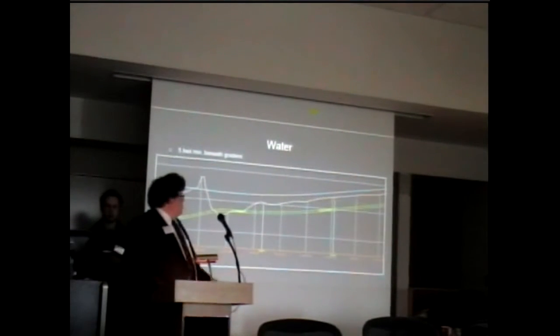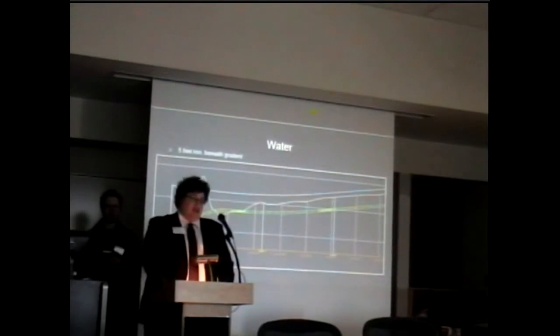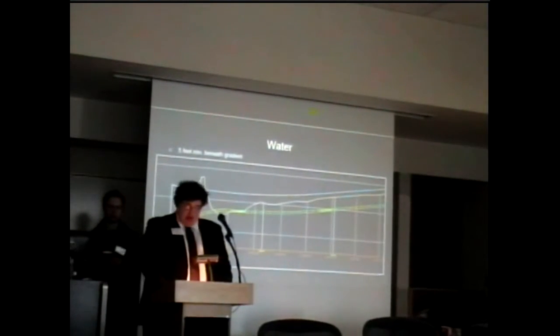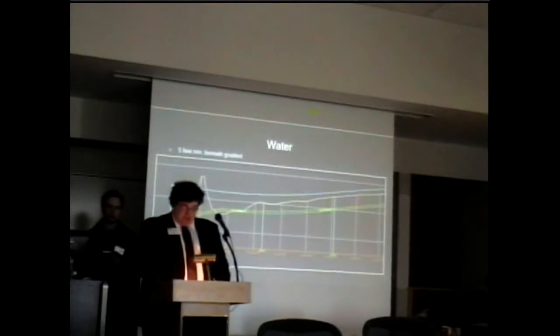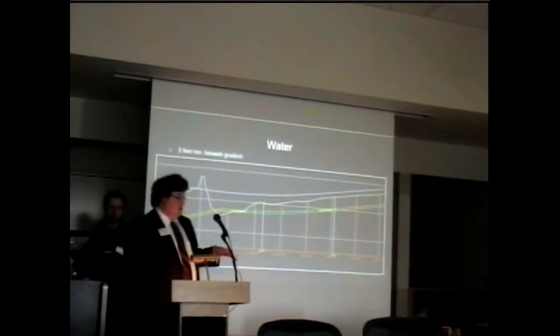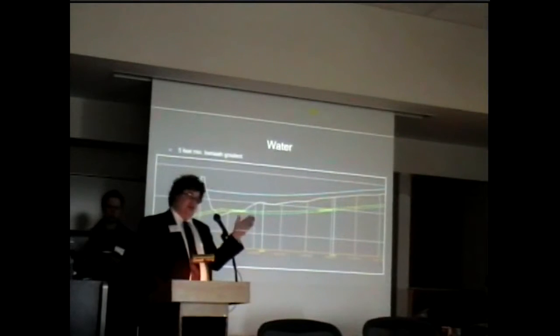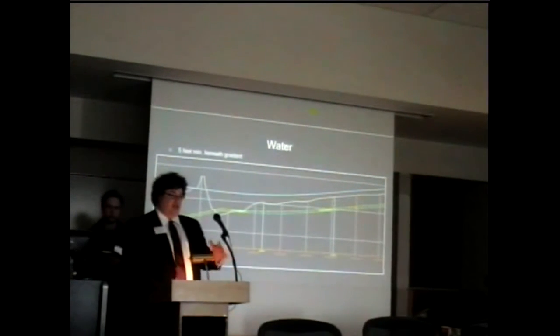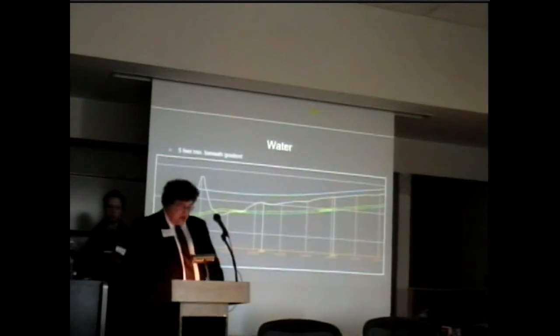The vertical for it is pretty similar to the sanitary, where we try to follow the proposed grade of the area as much as we could. Has to be 5 foot minimum. We tried to get it to be about 6 feet at the highest point below the grade, just to be on the safe side of things.